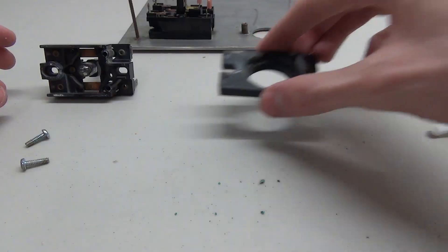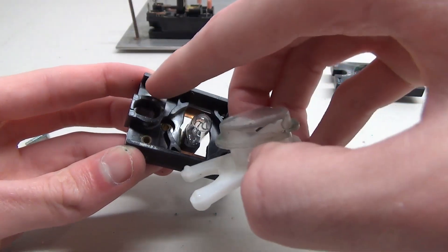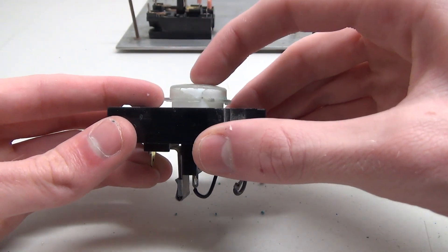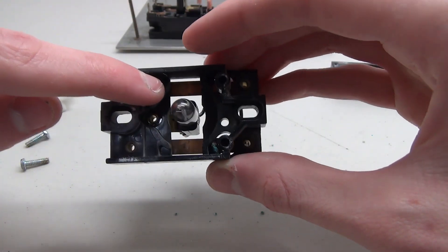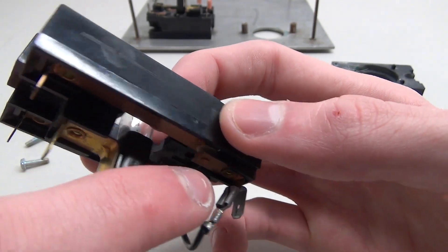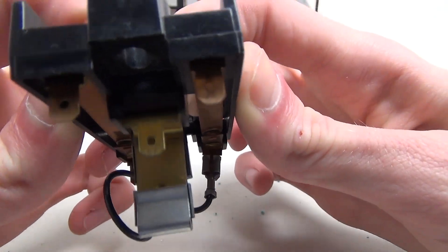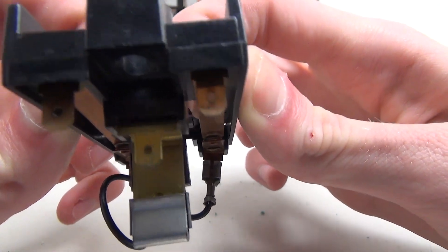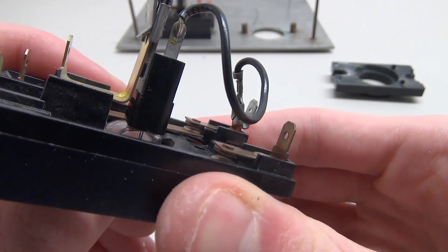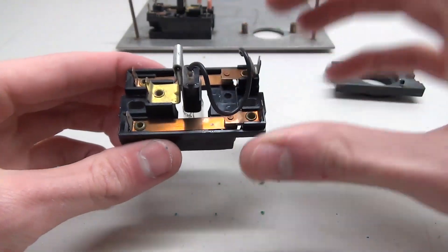Here is the base. These little round pieces sit on the holes, and this side presses down onto the two metal contacts on either side. When they press down, they complete the circuit. You can see two switches on either side that are broken open, and when the button presses down it completes the circuit. If you look closely you can see how little the gap is between the contacts — that's why they don't press very much, because you barely have to press them down to make contact.